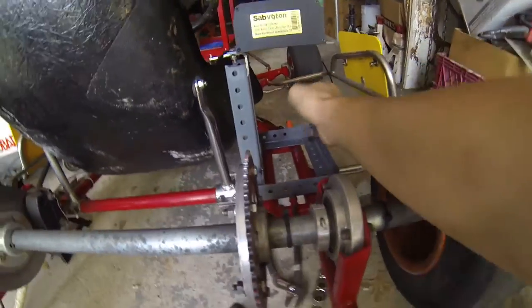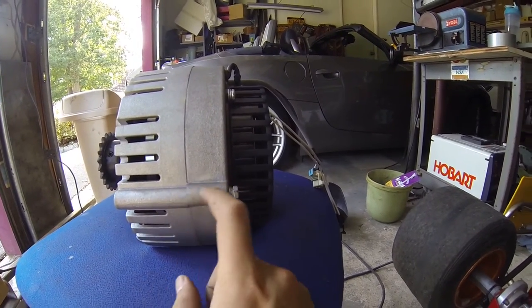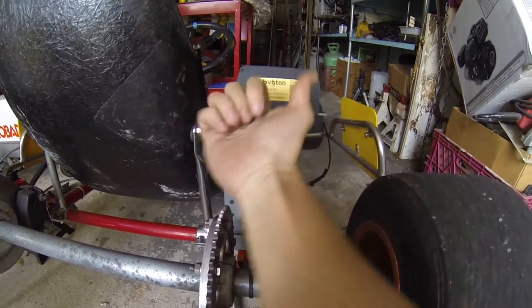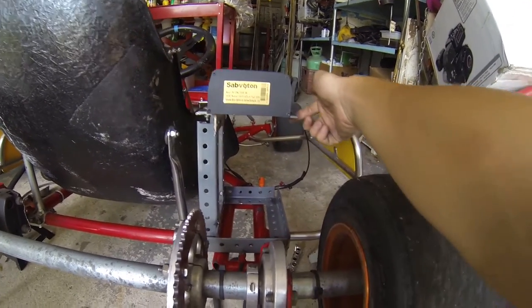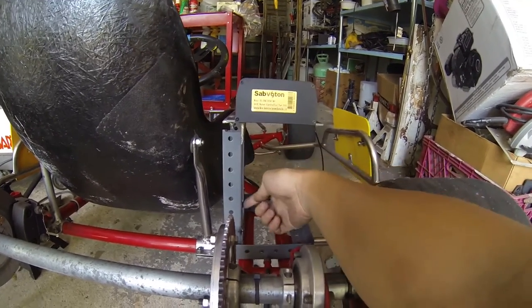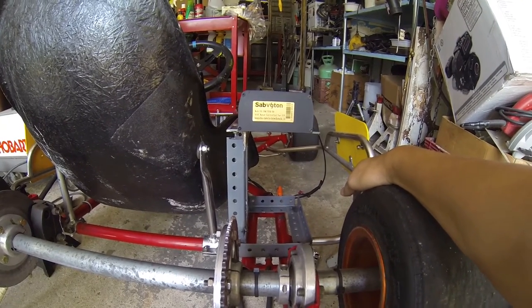Other than that, I really like how the controller sits on top. I've noticed there's a fifth mounting point I could probably use — if it's structurally stable it'll add a little extra safety, because holding with just the four mounting bolts might let torque twist things. I want to add a fifth bar up top which will also help secure the controller side, giving a total of five mounting points for the motor.